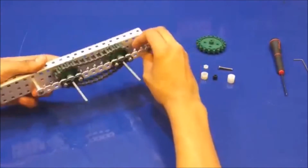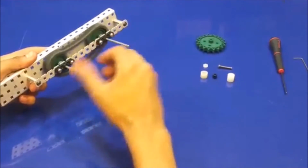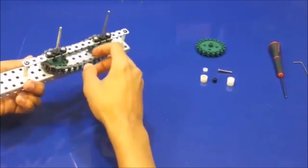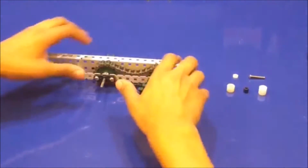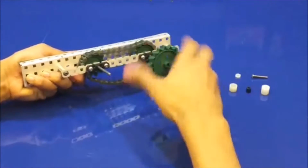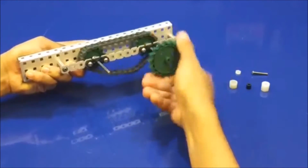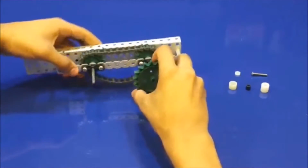Before tensioning, the mechanism spins freely. However, the chain is a bit too loose, which can cause unnecessary slop and shock loading. Although it may seem alright at first, when loaded, a common problem with improperly tensioned chain is skipping, which can cause malfunction, mechanical damage, and sensor drift.